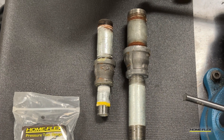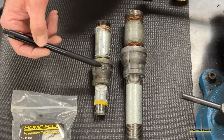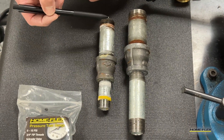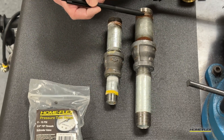If you need to fit your gauge to a pipe that's smaller or larger than three quarters inch, you can adapt it using bell reducers. Bell reducers will help you go from the needed three quarter inch size to half inch, or from the needed three quarter inch size to one inch.